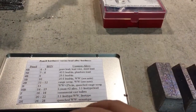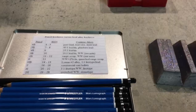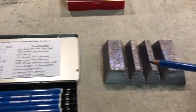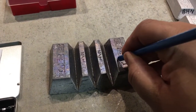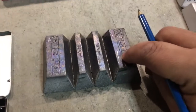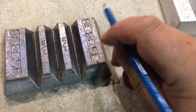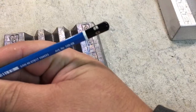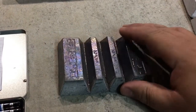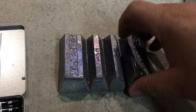This one is standard lead, and I know that standard lead is about 6B. So I'm going to grab my 6B pencil because I know this is kind of pure lead. But again, when you're at a flea market or garage sale and you find some lead and want to test it, this is a good method. You can see I put a nice gouge in the lead itself. This is the softest pencil I've got and it confirms this is standard lead — 6B. So I would go ahead and write BHN 4 or 5 on the end of the ingot so I'd know it's 4 to 5 BHN.